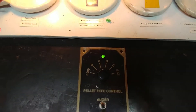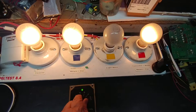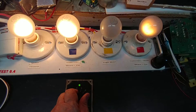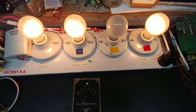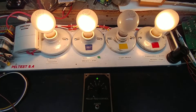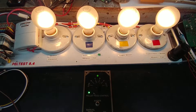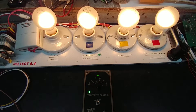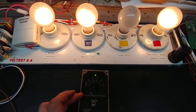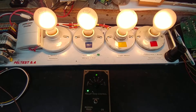So as we cycle through there, I'm going to increase the power to the element feed control — I'm on low right now. As I turn it, we can see the intensity of the light bulb get brighter and dimmer. I'll go all the way up to position E, and that will cause the auger motor to stay on much longer. We can clearly see the green indicator light in the background underneath the panel, and we can see that the auger motor light is staying on longer.